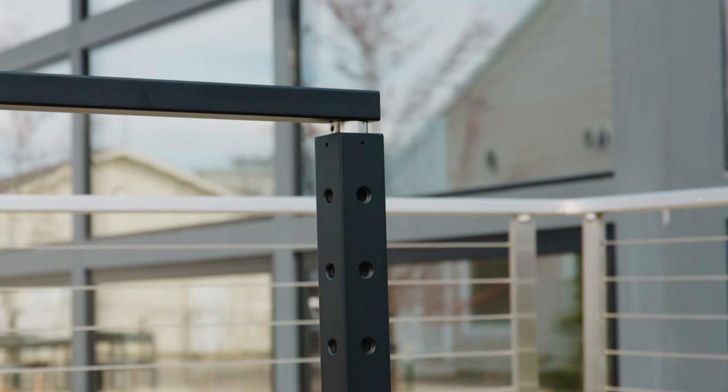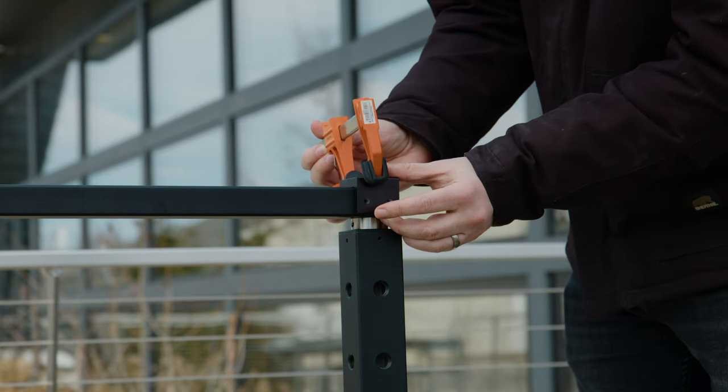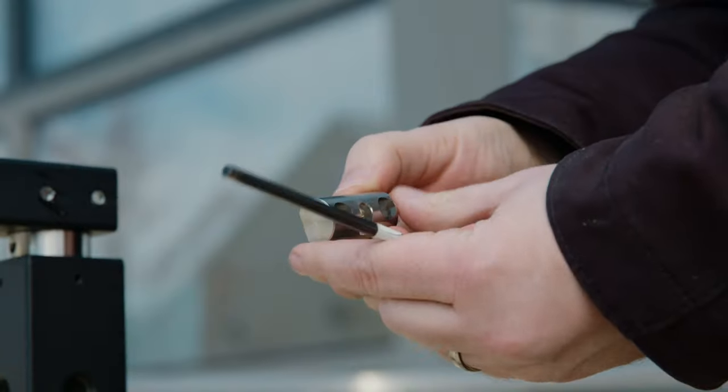We should be all set to secure all of our post tops now. If our stair railing were to make a 90-degree turn at the landing, it would change our process slightly. For this section, we need to make a 90-degree turn to continue our handrail down the steps. We've run the top piece up to the face of the post minus an eighth of an inch. Our post and level handrail are all fully installed and secured, but we haven't inserted the end cap yet. As a first step, we're going to bring in our handrail drill guide and template, this time setting it on top of the installed level handrail, flush against the cut of the handrail. These holes will be where we'll secure part B of our handrail hinge.